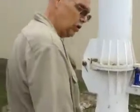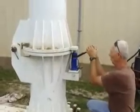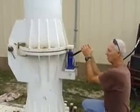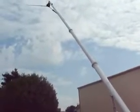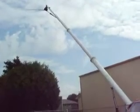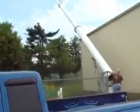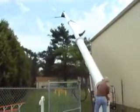All right, we will document that as we go. You can start to see the gap coming in here. Are you bleeding it? I'm bleeding it a little. Okay, leave it tight a second until I see how much it jacks, because I don't know how much air we're going to have to deal with — don't push on it. Stop just a minute — I'm going to go out where I can get a nice long look at it. And the rest of it is just a nice gentle lower to the ground. And down it comes. Once the air is out of the hydraulic system — which we're going to have to work on — you can see it's a nice gentle lower to the ground.